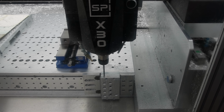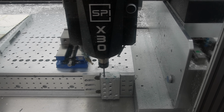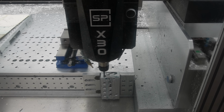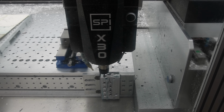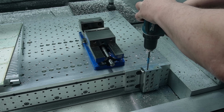For the cabinet with the pneumatics, I had to make a custom distribution block first, because the spindle requires different pressure levels for the drawbar piston and the cone cleaning, and I couldn't find any valve island for the Festo valves I use with different pressure levels on the market. If you know any, please mention them in the comments below.